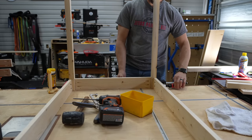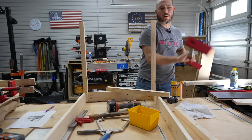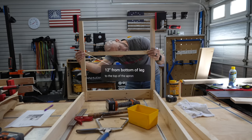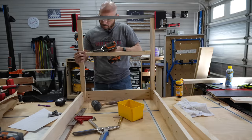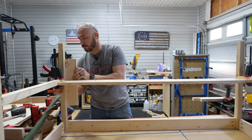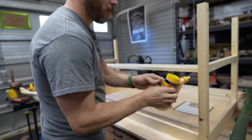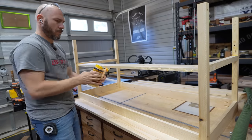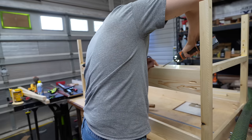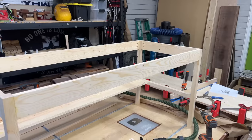It was easier to attach the front apron to the front two legs, the back apron to the back two legs, and then attach the side aprons. For the bottom apron, we're using a two-by-two on the sides. I measured down about 12 inches from the bottom of the leg to the top of the apron, then attached those with pocket hole screws. Now we're going to attach the shelf using glue and three pocket hole screws per end. I used a scrap one-by to inset it three-quarters of an inch and flushed it up with the top of the side aprons. I then put glue on the back and attached each end with pocket hole screws, then attached the back of the shelf to the bottom of the shelf with pocket holes from underneath. This really makes the whole thing sturdy.